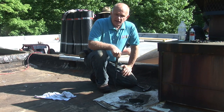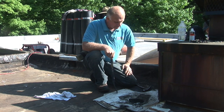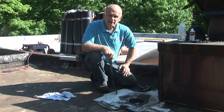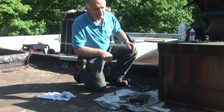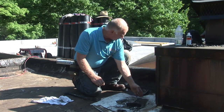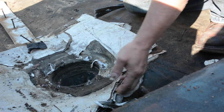This is another drain demonstration. This roof was covered with a TPO roof and they had to do some kind of detail around the drains. Drains are one of the most difficult parts of redoing a roof or doing a commercial roof. It has to be very well sealed and secured. You can tell by looking at this drain — there are about five layers of TPO that tried to secure this drain.